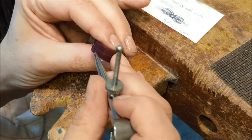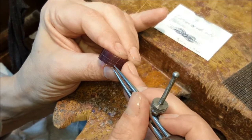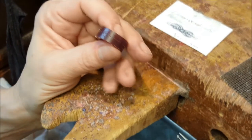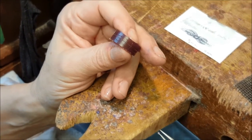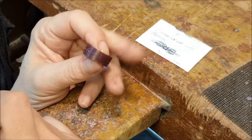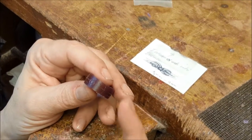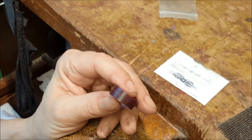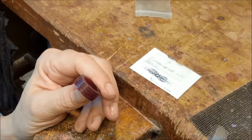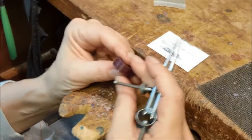You're marking that all the way around. Having extra reference lines is actually very beneficial — they eventually go away as you work the wax, but they help keep you oriented. The other thing I like to do is keep a square side or a flat side until the very end. So if this was a tapering shank, I would taper it at the end, and that also helps me keep a square reference.